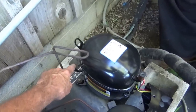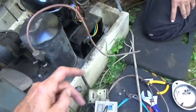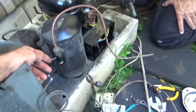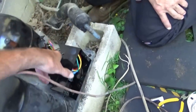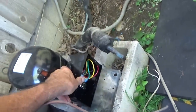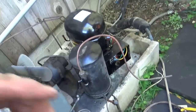I'm gonna put a Schrader fitting here. We had the low side pressure control hooked up to the old gauge port but I'm not gonna use that. I'm gonna put a fitting for the high side fitting here — I believe it's the fan control. I have to remount this someplace else. I moved it so that the electrical box was facing the wall before, which is very difficult to get at. Here the electrical will be out on this side, but it just means I have to reposition the pressure controls — I might put them over there.